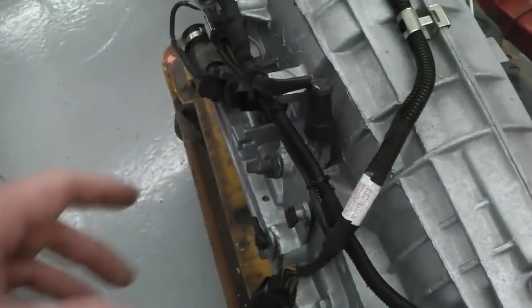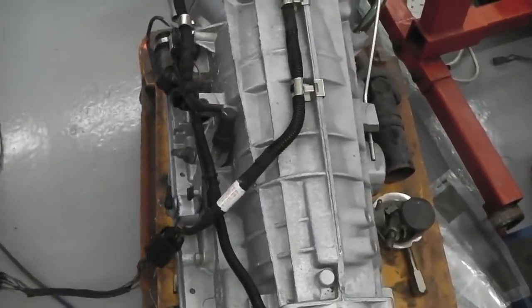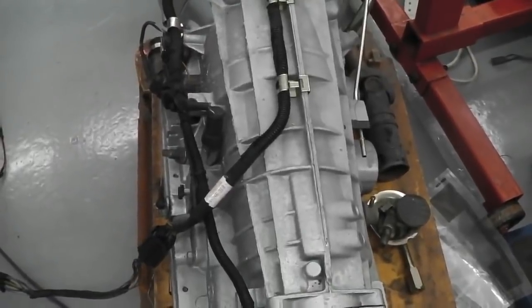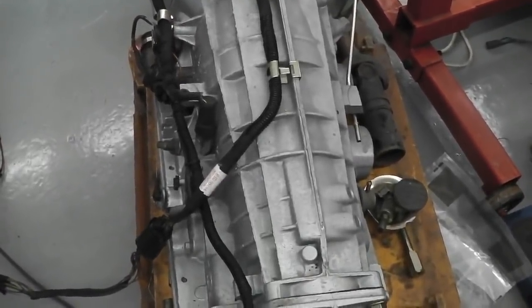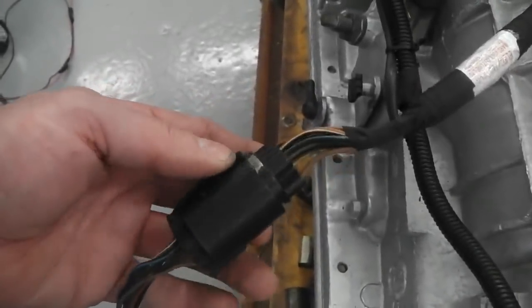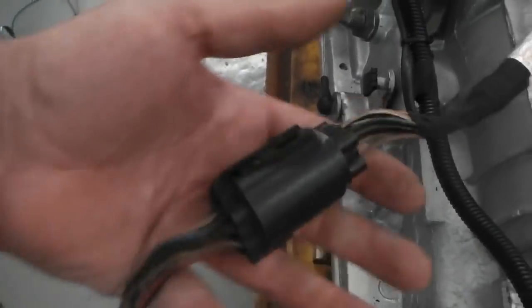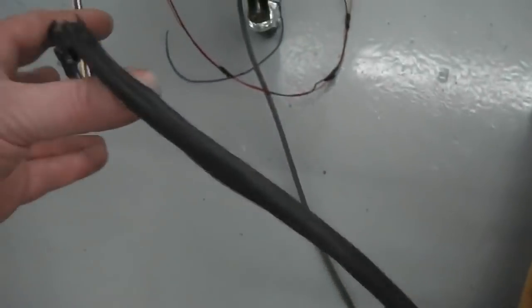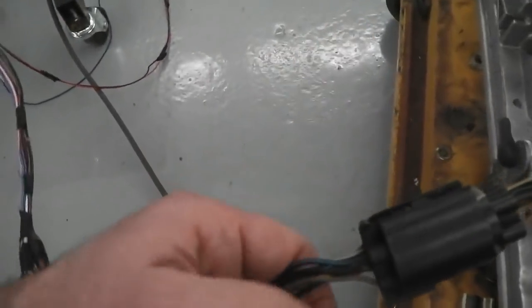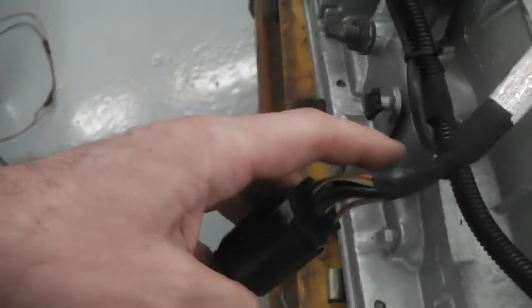That's a shame. Anyway, we'd have to have an extra multi-plug on there. And probably if I'm going to put an extra plug on it, I'd just do all 3 wires, ground, 12, and the output of it, and bring it on. So when you did take the gearbox out, you'd now disconnect 2 looms, but it'd only be an extra 3 wire loom. I don't think that'd be a big deal. And then you just tag it along this loom. We've not wrapped this yet, so you could tag it into the loom so that it breaks out here on a separate plug. So you still have 1 cord, if you will, but 2 connector plugs here. And then we could fit the sensor on the gearbox out of the way.